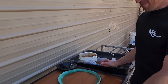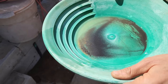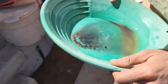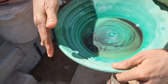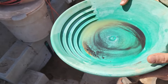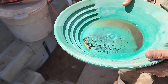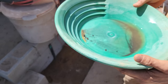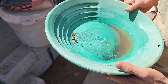Absolutely. Thank you. Well, we're getting her cleaned up here again, and one of the other things we were talking about is if we have roughly 2 to 3 grams in what we ran, we only ran 1,350 pounds. And so that would increase the value of the ore to about 4 or 5 grams per ton, which is about what they were getting on their assays, it sounds like. So that would have this bulk sample square with what they're getting in their assays, and then they can have a real good idea about what they're gonna go mining here in the future. And we haven't even touched the Bs yet.